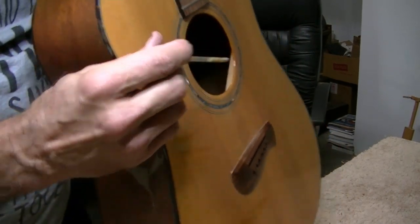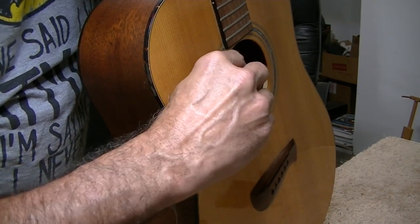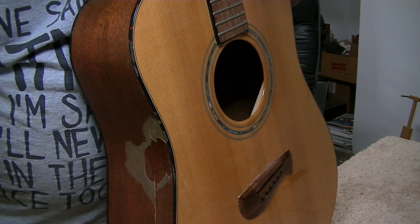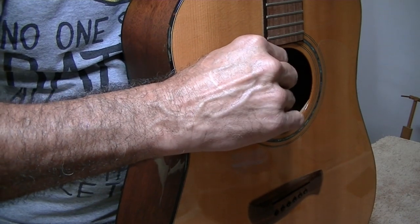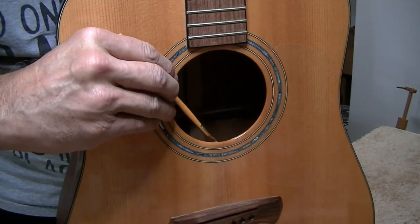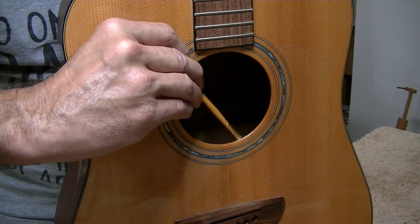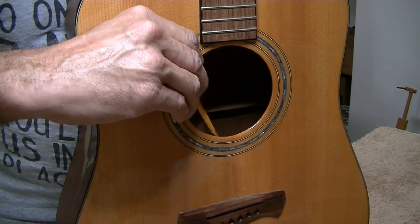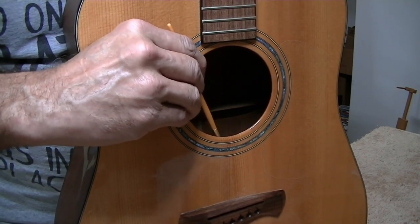I know you're not going to be able to actually see me applying this glue, but you can see my technique here. I've got a pipette and I've squeezed glue up into it, and I can just get that pipette in there perfectly right in the crack. Just getting some more glue in there — it's squeezing kind of like a syringe, and a syringe would work too. I've got quite a bit of glue in there now. I'm taking this brush — it fits right in the slot really well — and I'm just painting the glue along the crack, sticking the brush all the way through to make sure there's a good even coating everywhere.